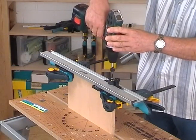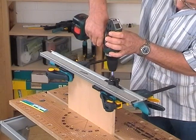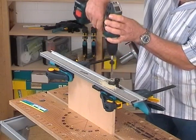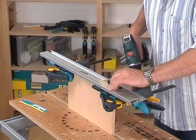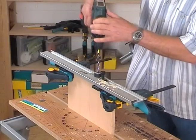Start with the first drilling and bear in mind the corresponding number on the guide rail. Please pay attention that you always start at this place with the dowel holes. Thereafter, just engage the sliding drill head on every third drilling, fasten it and drill with the 10mm drill a dowel hole.